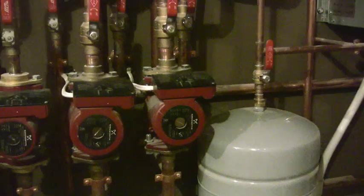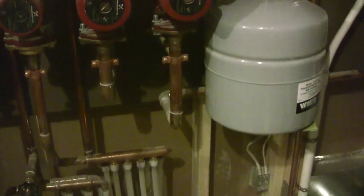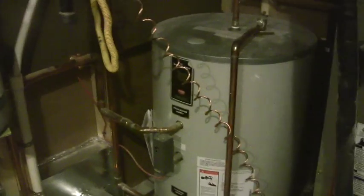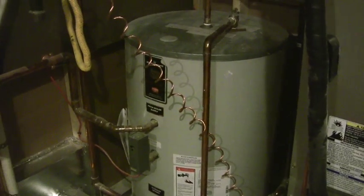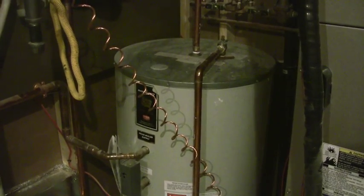My very first takeoff is a bigger pump running one inch so that my boiler gets enough flow. That heads over here to my domestic hot water, which runs off my boiler. It's the best way to do it because then your boiler is firing your hot water.